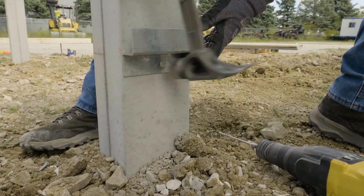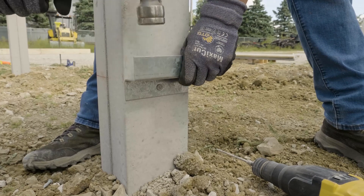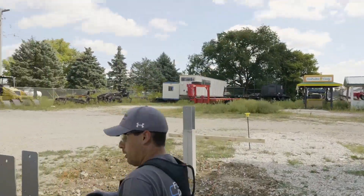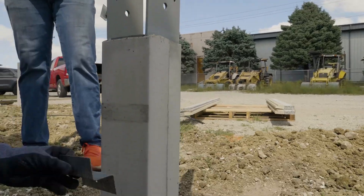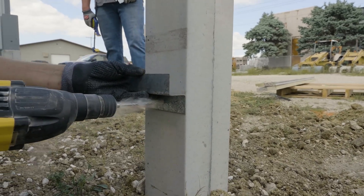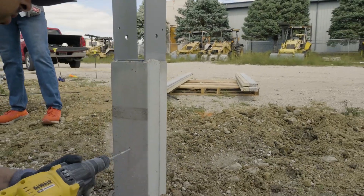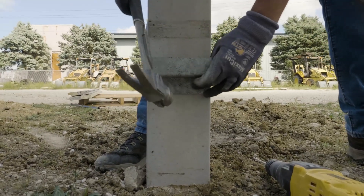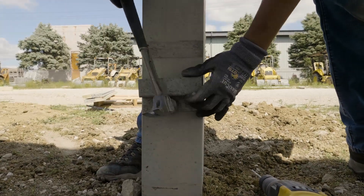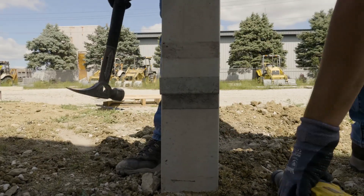For that first one I used a clamp to put it in place — that makes things easier and I generally like it that way, but you don't necessarily have to. If you feel comfortable holding it up to the level line, go ahead and line it up with the chalk line, find the hole, and get a pilot hole shooting right for the middle of that perma column so we don't hit the rebar.